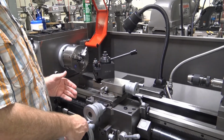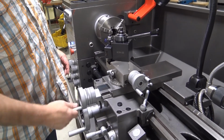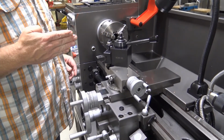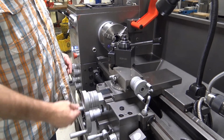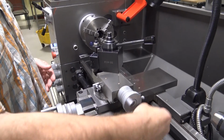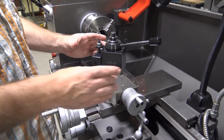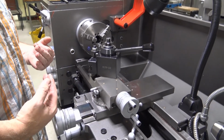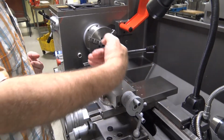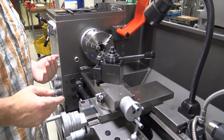On top of the carriage is mounted a cross slide. The cross slide moves in the X direction on a lathe. On top of the cross slide is a compound slide. The compound slide is able to be rotated to any angle. For the purposes of our labs, we mount the compound slide at 0 degrees to the axis of rotation. This gives us a higher level of dimensional control.